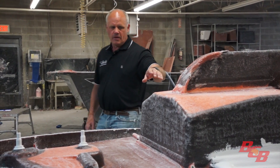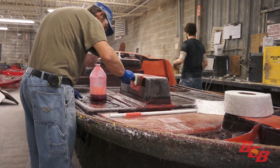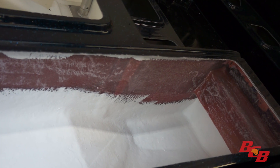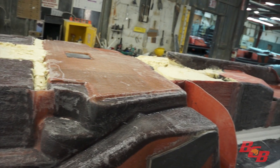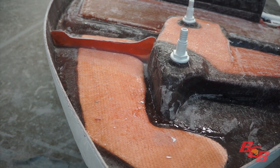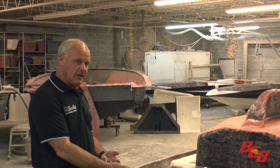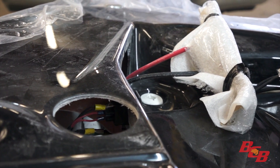This is a Puma FTD. The Puma FTD, Cougar FTD, and some of the other boats have full box assemblies and finished boxes. Some of the others, like the Pantera II and the Sabre, don't — they actually are inside a finished box, but it's not gelcoat slick; it's smooth and brushed. The partitions on this are all done in fiberglass. This is a pretty slick part right here on the front — it pulls all the flex out of the front trolling motor area. It takes that flex out of the deck where that trolling motor works. Then we come to the back side of that trolling motor and use three-eighths plates under it to support the trolling motor bracket. But this is boxing — this is where the deck assembly on the Puma FTD is.